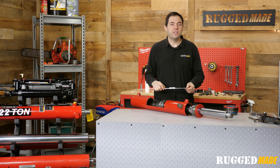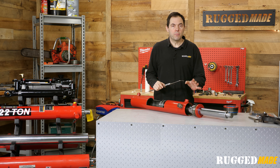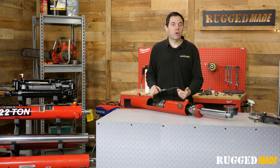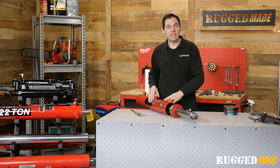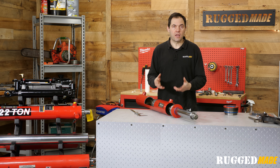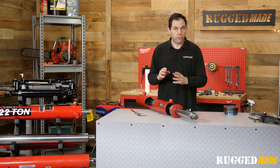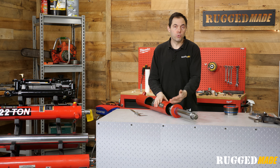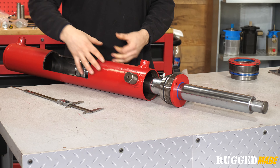This is the key dimension that you need to match. You may not need to fully remove the whole rod and piston to get this measurement, but make sure the rod is supported so that it stays aligned with the barrel — you don't want the edges of the piston damaging the inner surface. The threaded portion near the opening of the barrel might be machined a little bit thinner than the actual ID where the piston sits, but generally the dimensions are going to be so close that it will tell you what you have. In this case, a 4-inch ID cylinder. If you want the most precise dimension, you can remove the rod completely and use a bore gauge to measure further inside the barrel.